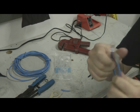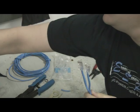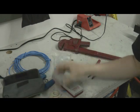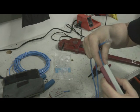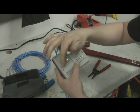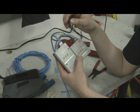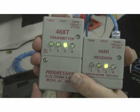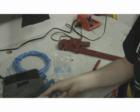This cable could be going into a wall running 150 feet somewhere important — but that's how you make a cable. I grab my Progressive Electronics cable tester with the T568B standard shown on the right. I plug the transmitter in one side and the receiver in the other, and turn it on. All those pins are green. If you fail to make a connection, a light won't show up; a reversed wire shows red; wrong order and they'd jump around. That is a proper connection — a good cable that'll last for years and provide good service to your customers.